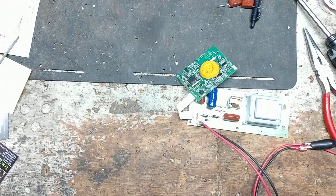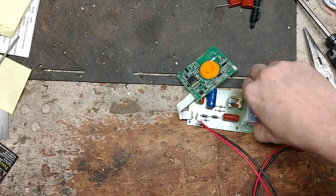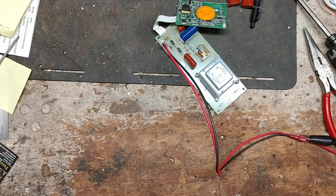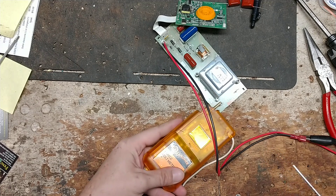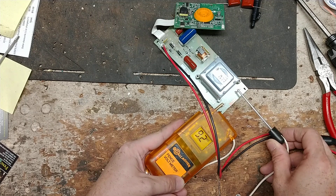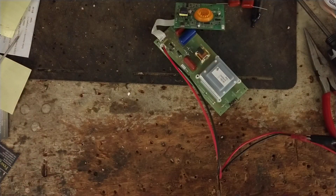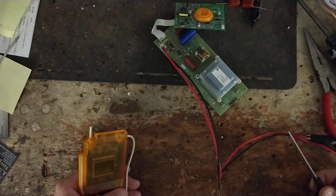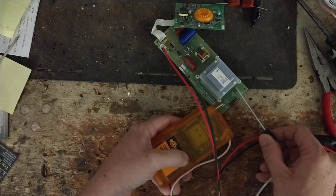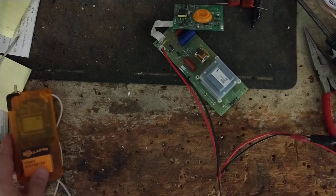With the overhead light on you can see it does a nice little spark. These are half-joule stored-joule units. I'll put a tester across here — we're getting 9.2 kV out of it. Now I'll turn the light off to slow the pulse down — about every two to three seconds — and we're still getting 9,000 volts out of it. So it's just as strong, just a slower pulse.